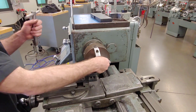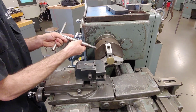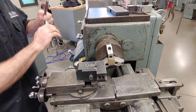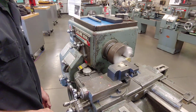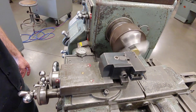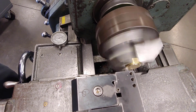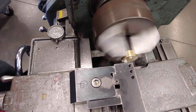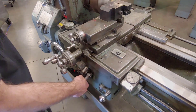The soft jaw has a contour cut into the jaws, so it holds the workpiece concentrically around the lathe's rotational axis and sets the stick-out distance for the part. Therefore, we can lock the carriage in place and only use it to face off the workpiece — no adjustments need to be made in this operation. We auto-feed the part across the workpiece to the center in order to face one surface of the crank disc.